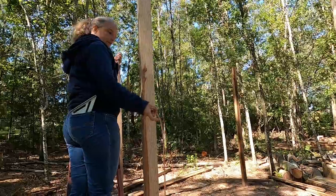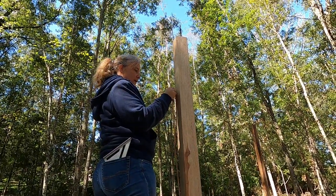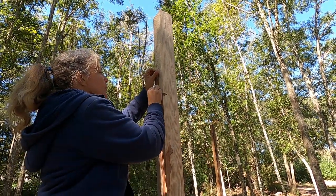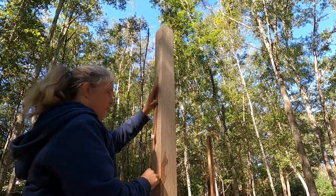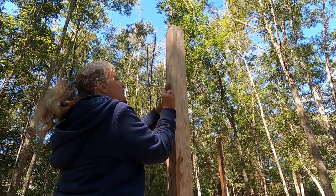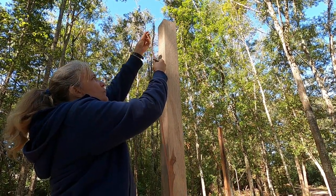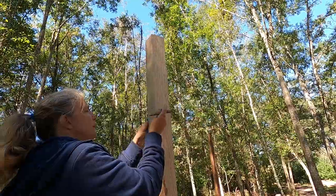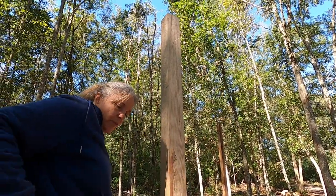We have about five miles of hose on this water level. Let's see where we're at — we're going to unclip it and bring it down so that the water meets my line. We'll give it a minute to make sure the water level has equalized. It hasn't moved, so we're going to mark that, then let the water come down below the clip and clip it off so it doesn't leak out. On to the next post — I sure hope this is working because it sure is easy if it is.